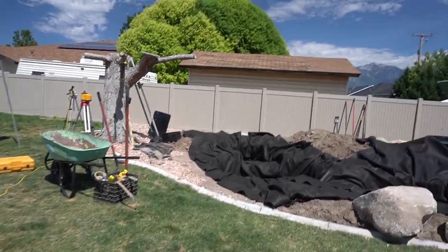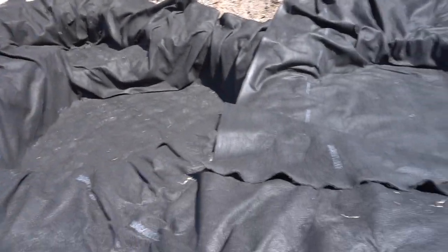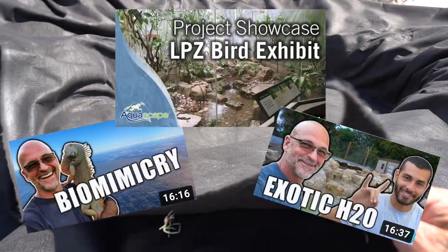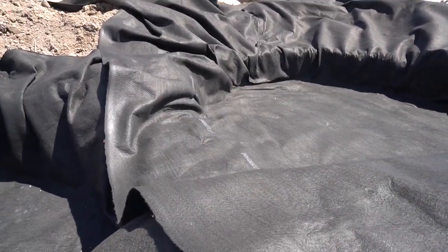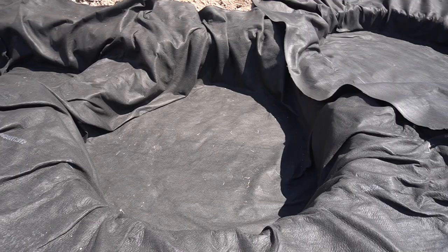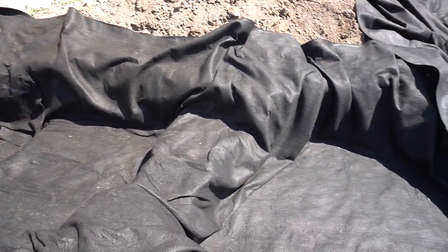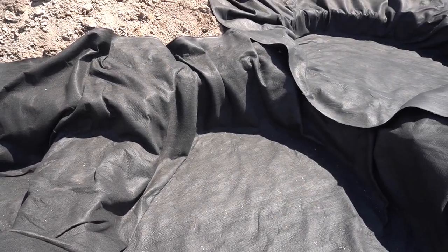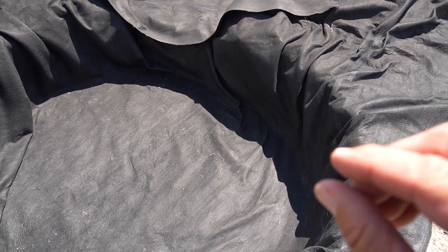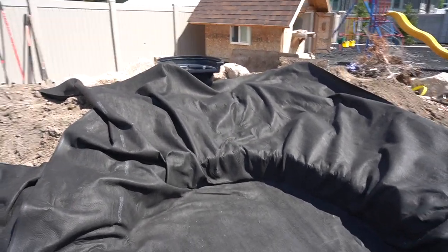All of our products arrived. We have our pump vaults — the pump vault area has been excavated out, and you can see the vault sitting right over here going in the back corner. We have our heavy-duty geotextile fabric. This is the really thick stuff and it's the material I use on heavy-duty applications. Anytime I'm working with animals that could be burrowing or digging, or anytime I'm setting really large rocks, this is very inexpensive insurance that's going to help protect the liner. This material resists stretching and pulling and increases the load bearing capacity of the soil. The soil here is pretty soft, which is good for excavation but not great for setting large boulders on. So by putting this heavy-duty fabric, that's going to spread the weight out over a larger area, and we're going to sandwich the rubber liner between two layers of this material. It's going to help this project last for many decades.